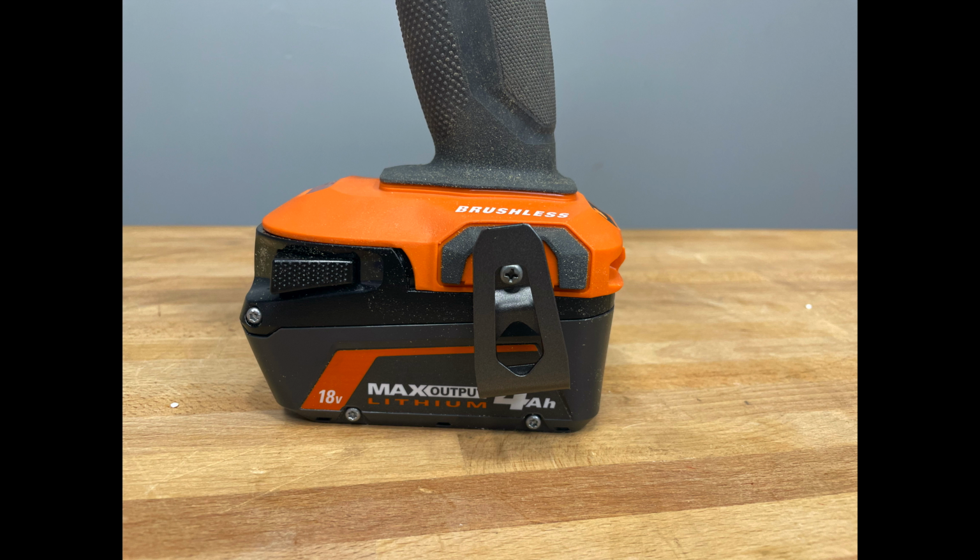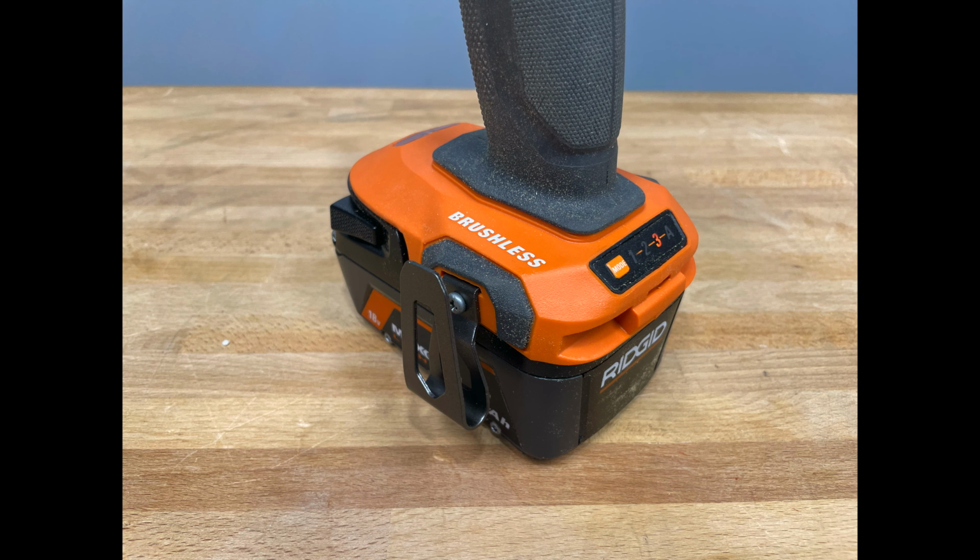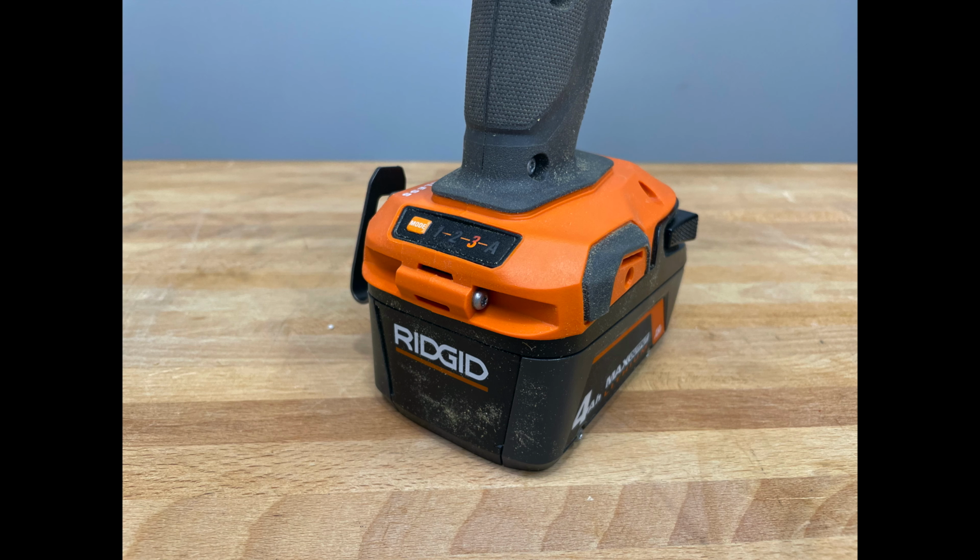Okay. The brushless motor technology that you get with this tool gives you increased motor efficiency to deliver maximum performance for longer and extended motor life. Okay. This tool has 650 foot pounds of breakaway torque and about 500 foot pounds of tightening torque. It is versatile by being 10% more compact. It has three speed modes and an auto tightening mode. This model has a friction ring.